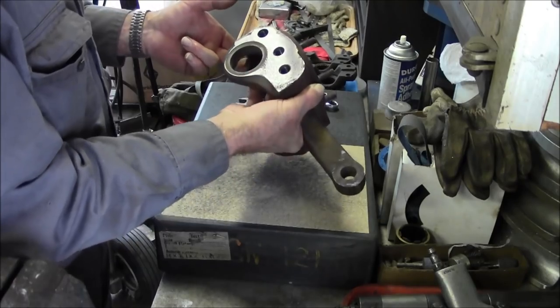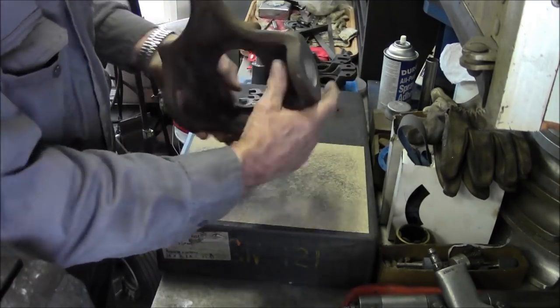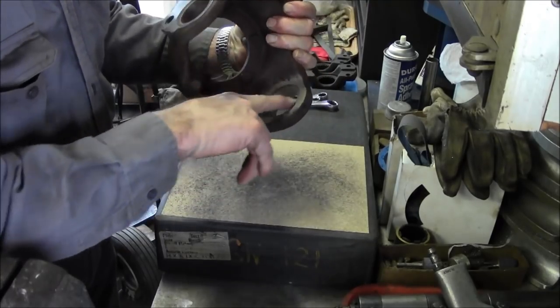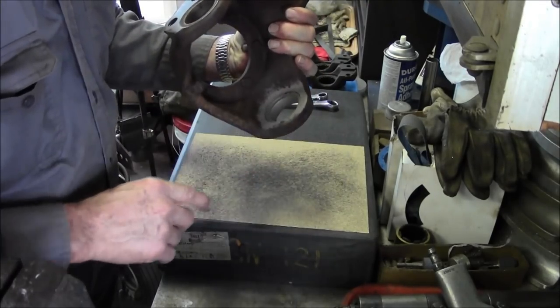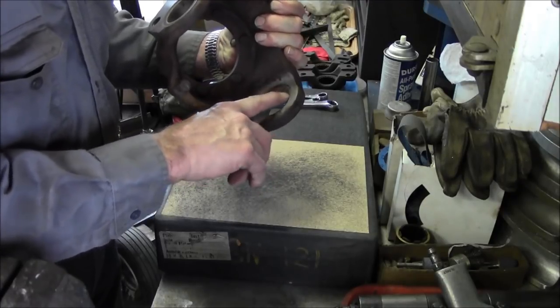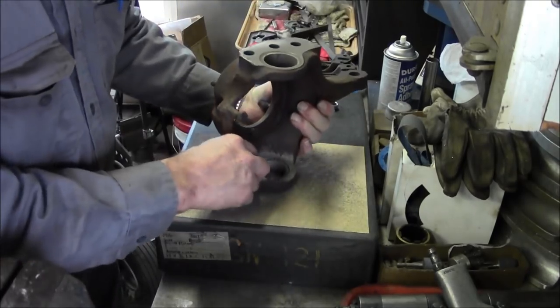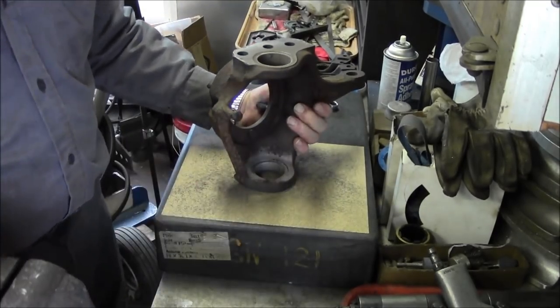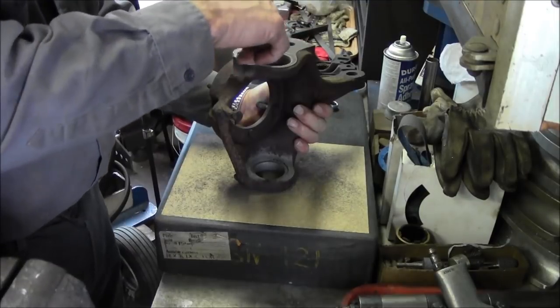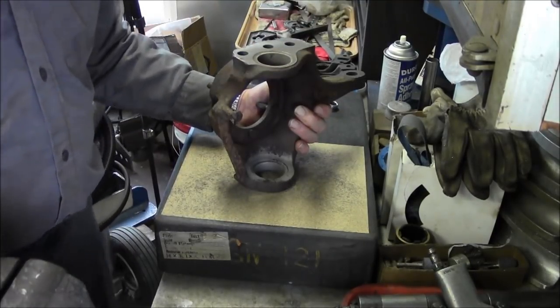We're going to go over to the lathe and start turning a donut. It'll have a half inch draw hole and a little lip that'll grab hold of this lip right here, because that's machined flat, and slight clearance for that bore. Then that'll be able to clamp that down. We can come up here and dial a zero in and set our alignment and all of that on the upper holes here.